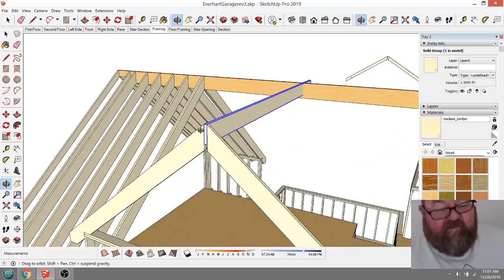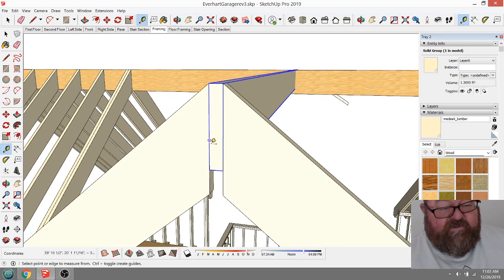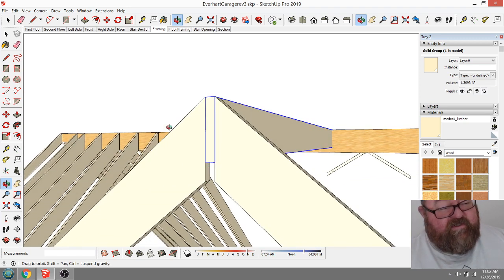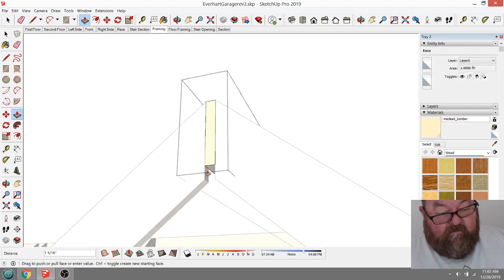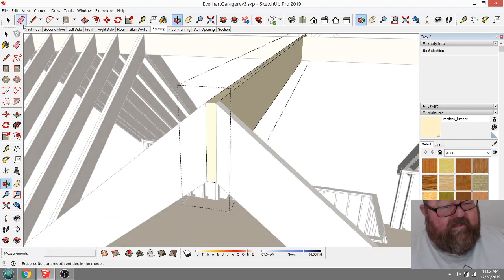But what I'm going to have to do is, our building inspectors are picky about this. They don't want you using a ridge that's shorter. What is that? Yeah, I'll have to use an LVL. Let's see. Well, can I? I could probably get by with a 2x12 on this since it's like a dormer situation. But I'm going to show it coming down to there because that's what it needs to. That little gap.